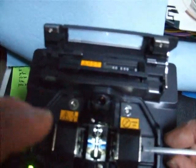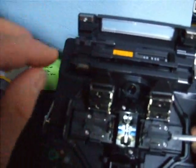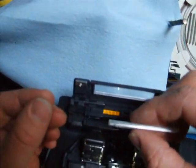Here I have the fiber — I pull it out, I slide the sleeve along it, I slip it into there, and I close this cover. I pick up my light again, gently put that in there, and by moving this back and forth you can see where the splice is inside to make sure you've got it centered. You let it down again and press the heat button.